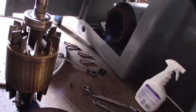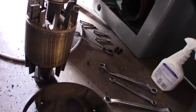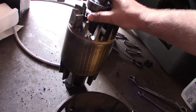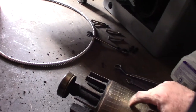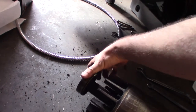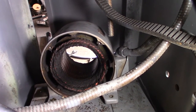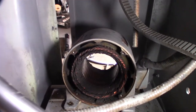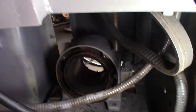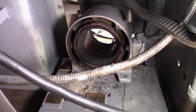I might have to wipe it down. I don't know if I want to take the whole motor out and spray it off. Maybe I'll take the back plate off and clean it out too, but I'm obviously going to clean this up and blow it out with degreaser. The bearings themselves are right here, and you can see like someone's been rubbing right in here. Look how much grease and oil is still in there. The front bearing usually goes out first because that's where the majority of the load is when it comes to the belts — wherever the pulley is.